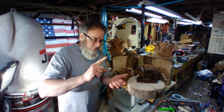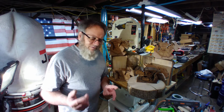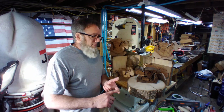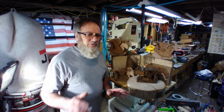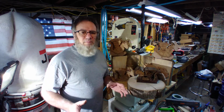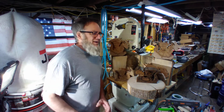I replied, not in this particular order, that if you don't feel comfortable and confident in a certain procedure, don't do it. For starters, I'm very confident in what I'm doing. I've been doing it for more than a few days. Another suggestion is to have a very sharp blade on your table saw. You could be doing everything right, but a dull blade is going to burn your wood, catch it, and throw it right at you. Please look up the series on any tool that you see in my shop. How about not standing right behind the wood? When I was pushing that stock through, I was to the side of the cut.